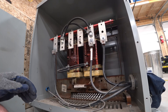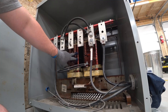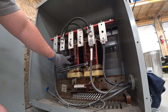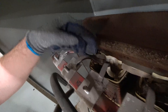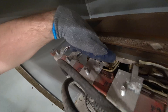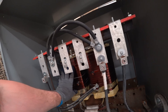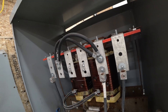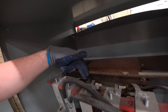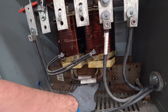The primary winding is the one that's on the outside — we've got this outside coil and it's actually two layers thick, layers one and two. So this is part of the primary winding and this is part of the primary winding — the outer two coils. The secondary winding is the inner two coils. They actually soldered it together right here.